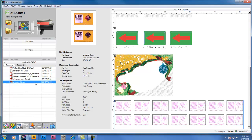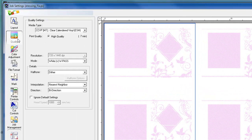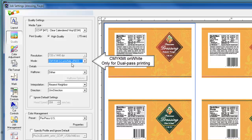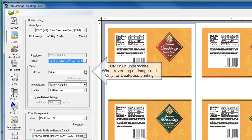After printing the white data, I can now set up the second pass to print the CMYK and metallic silver data. Going back into the quality controls, I'm now going to change the print mode from white over to CMYK MT on white. CMYK MT on white is designed exclusively for dual pass printing because the profiles assume that you've already printed white separately and you're now going to be printing CMYK and metallic silver on top of white. If we want to change that for reverse printing, we would select CMYK MT under white, which assumes that you're going to be reverse printing an image.